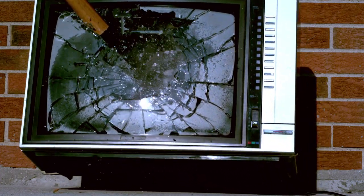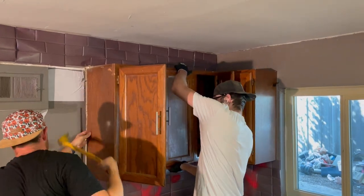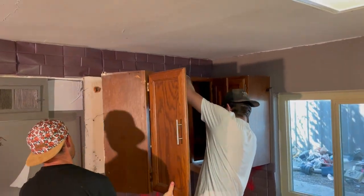What are you going to do yourself to demo this kitchen, and what should you look out for? People think it's all about coming in with a sledgehammer and going crazy — ripping everything out, Kool-Aid Man through the wall. That's glamorized on HGTV shows. But as the general contractor, I like to do more of a surgical removal — keep the cabinets in one piece. They were put up in one piece, so they'll come down in one piece. If you can deconstruct it the same way it was put together, it's going to be easier, clearer, and probably just as fast.